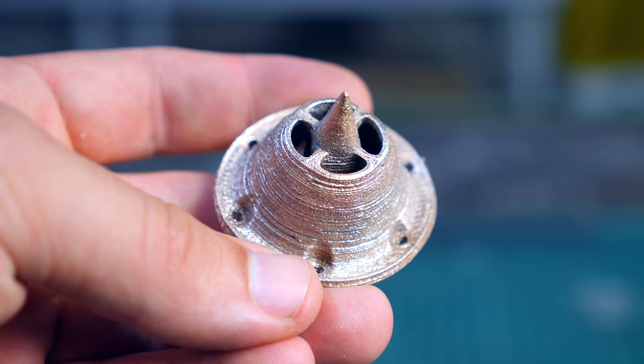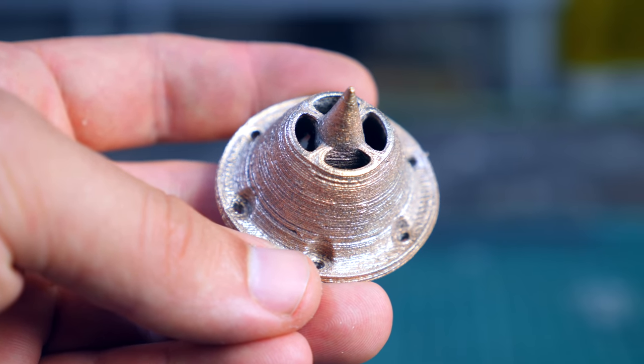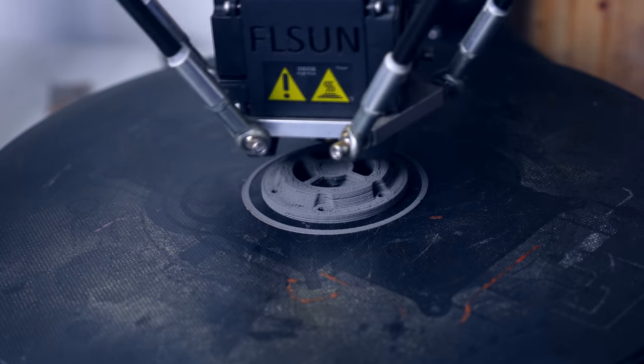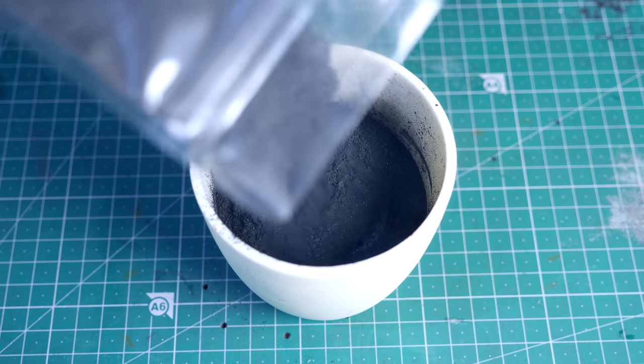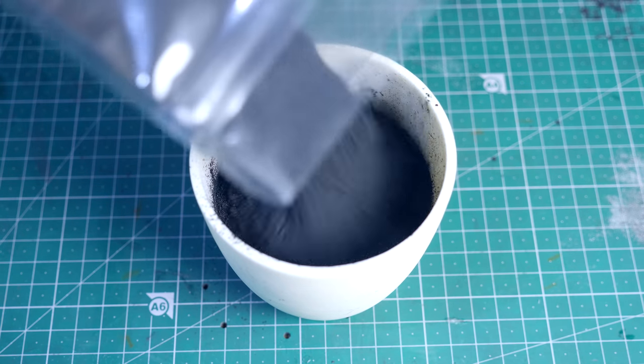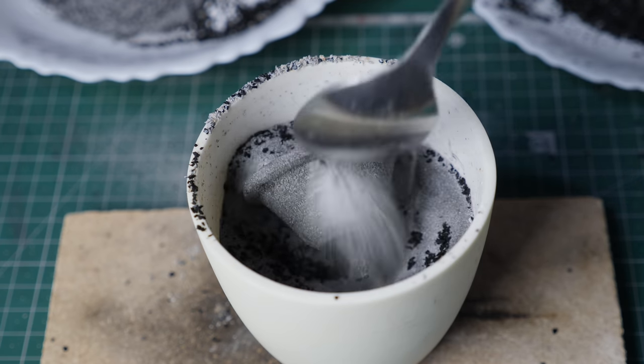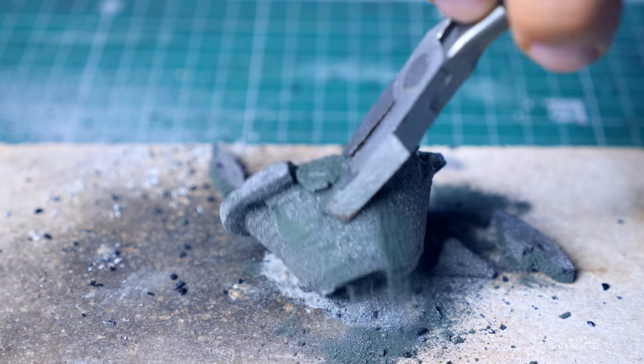Back to the project. As good as bronze is, it's not enough to satisfy my hunger for metal. So I got some steel filament. I 3D printed the exact same nozzle in a PLA filament with a lot of steel in it, and I put it back in the sand cup. Except this time I used a different kind of sand, because steel needs more temperature and the alumina sand couldn't handle it. If you're curious to see what happens when you take out the part right after the debinding stage — this is what happens. So I had the steel part inside the ceramic cup with the sand and all the stuff, ready to go into the kiln. But because I didn't really like the insane amount of time I had to wait the last time, I called the inventor of the filament and asked him if there was a way to shorten the thermal cycle.